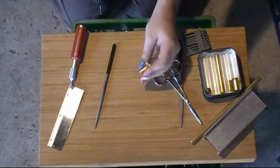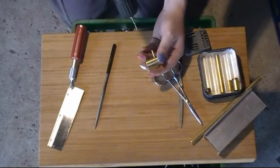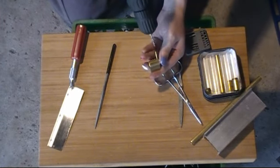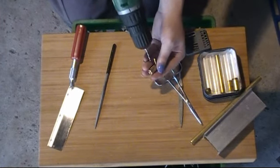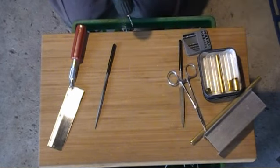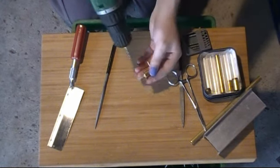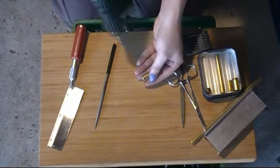And so I got it all aligned, I've got it inserted in there, I've got the rod holding everything in place, and I'm going to do the pilot holes. I might go most of the way through. I find it easier to just get a nice guide and then do it by hand, not assembled, because I don't want to damage the core. If I have to cut a new plate, that's not a big deal. If I need a new core, then I need a whole new core. So I should probably be clamping this up, actually.